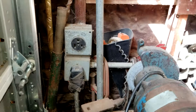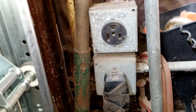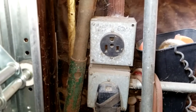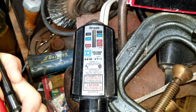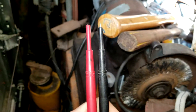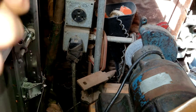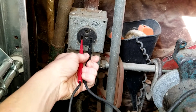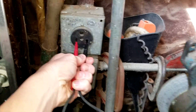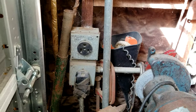We've located our plugs right here — these are our 220s — and unfortunately neither one of my electric charger Level 2 plugs fit in these slots. The first thing we're going to do is use an old-school voltage tester. We have our little prongs and what we're going to do — number one, we don't want to be electrocuted — so we're going to go ahead and test to make sure the correct breaker is the right one. I stick these in the prongs and as you can see, that has juice to it.